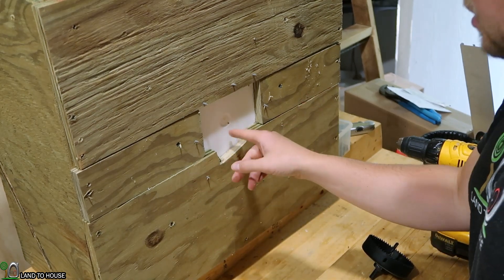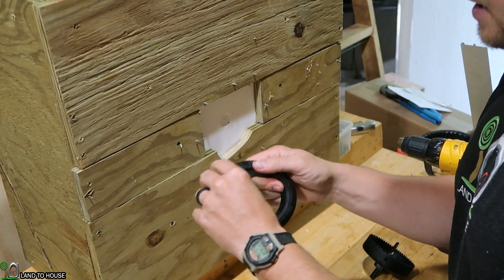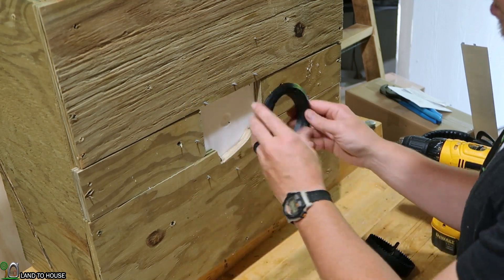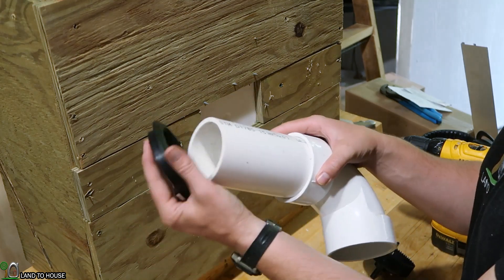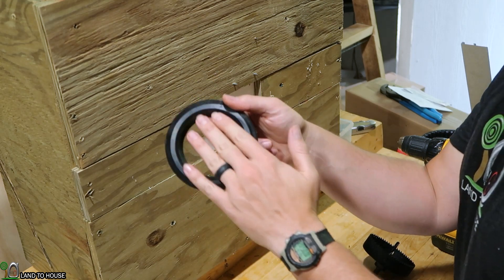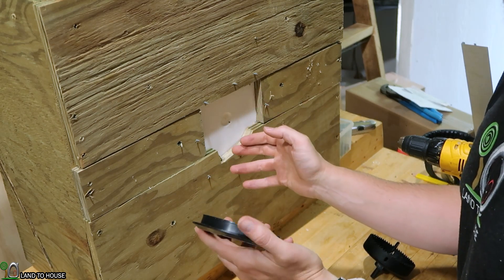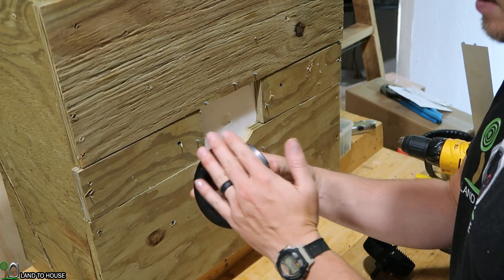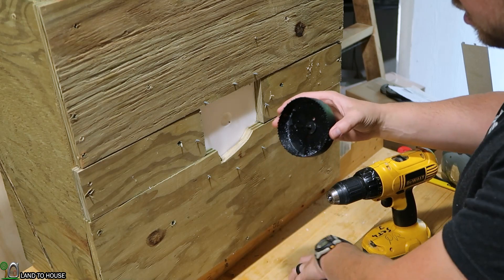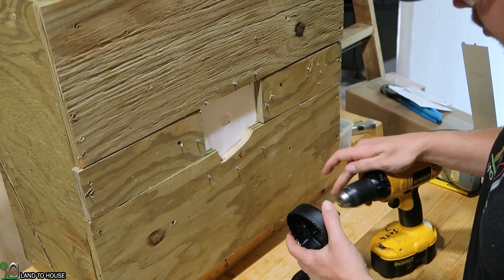Now I'm just going to go along the border of all of this to make sure it has a nice watertight seal. This will be complete down here except for the hole in the middle. Now that I have the inside piece caulked together, I'm putting in this rubber grommet — it's called a uniseal. Uniseal actually sent several of these for this microhydro project. What this does is allows you to put it into a surface like this, then press a pipe down onto it to make a watertight seal with a very low profile. The main reason you'd use one is if you don't have access to the inside of a tank, but in my case it's perfect for that low-profile look. Let's go ahead and use a hole saw to fit this uniseal into the bottom of my microhydro box.